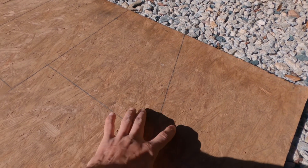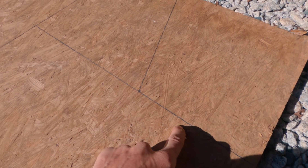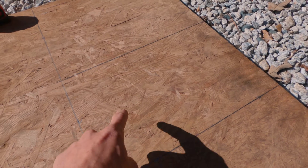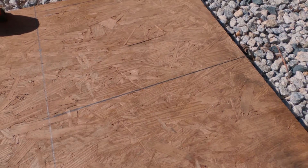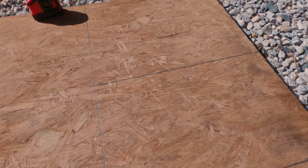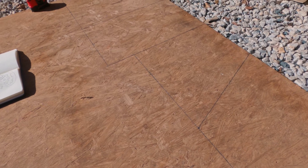I made my measurements here. This section is going to be my vertical pieces — I just made it into one square and divided it. I have my 9 inch section across the top, 14 across the bottom, and 13 inch height. Once I cut that out, these will be my two vertical pieces. And I've measured my two shelves: this rectangle is the 10 and three quarter inch depth with a 17 inch width, and this is the 12 and a half inch depth with the 17 inch width. That should give me my two shelves, creating three compartments within the cargo box. I'm going to go grab the skill saw and get some screws and cut all these pieces out.